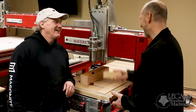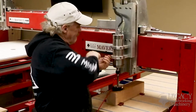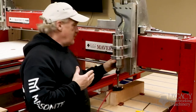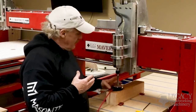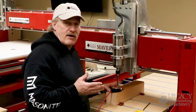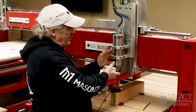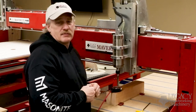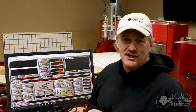Should we set up and start cutting? Let's do it. What I just did here is I adjusted my spindle height to accommodate this thick material with a long cutter. I also wanted to put my smart tool pad under here so I could reference the Z value for my cutter — it's a really nice feature of this machine. It allows you to adjust the spindle height in the brackets to accommodate thick material. Our part is all set up in the machine, so let's hit the switch and get started.